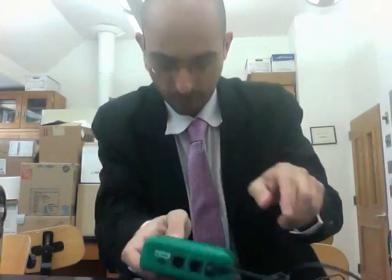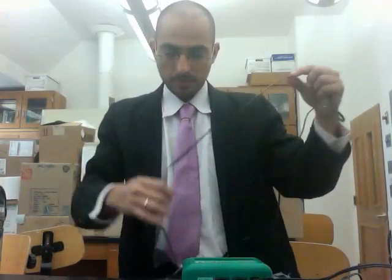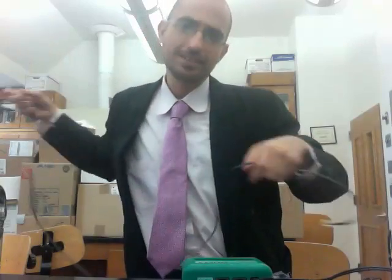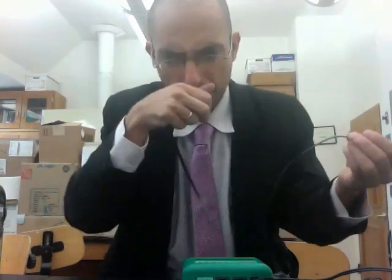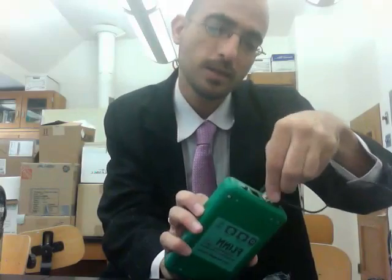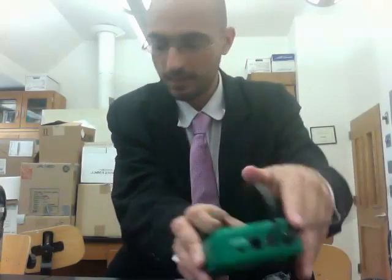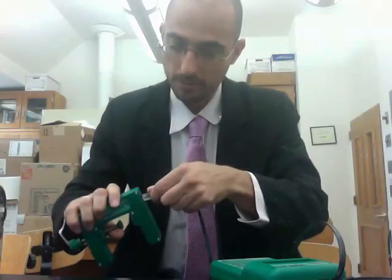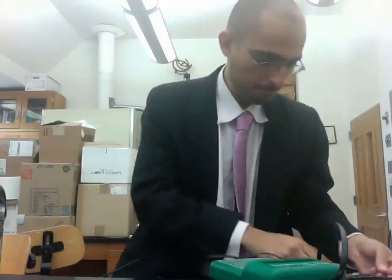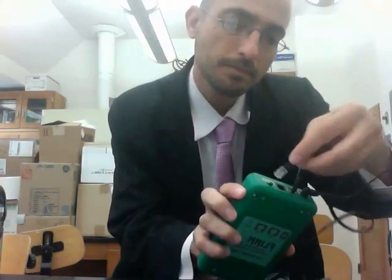We have two holes here for the two gates. The one closest to the power supply is the one that gets timed first. Two-gate mode keeps track of the time from the first gate to the next gate. There's no uncertainty added because it's timed from when the gate is completely blocked to when it's completely blocked again. That's gate A — whichever one you plug in becomes gate A — and gate B is here.